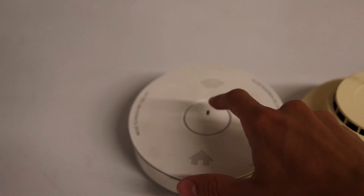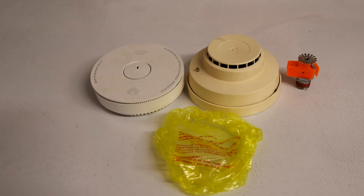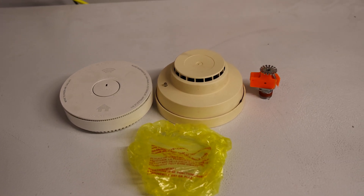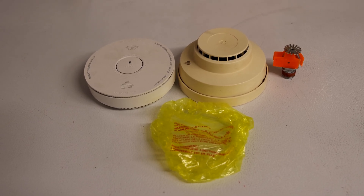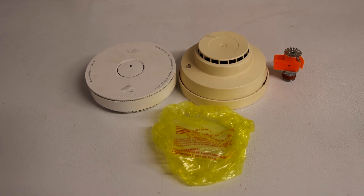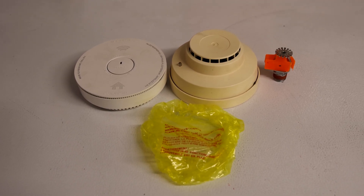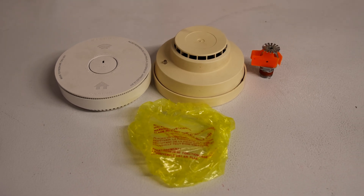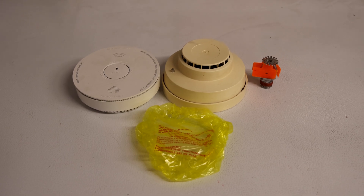While you're doing that, it might not be a bad idea to push the test button and make sure they have working batteries. NFPA 72 Chapter 14 also states that smoke detectors shall be visibly inspected to ensure that they are not obstructed or covered and that no paint has been applied to them. So essentially, if those covers remain on the units after construction is complete, it is officially not up to code.